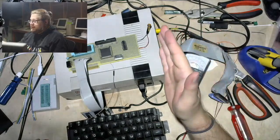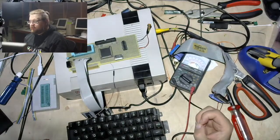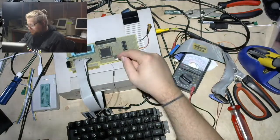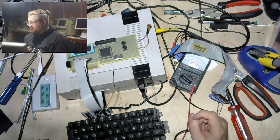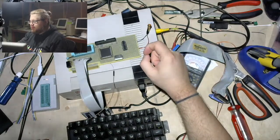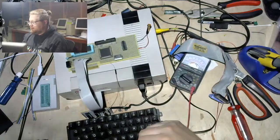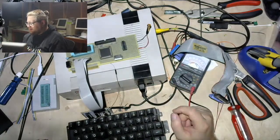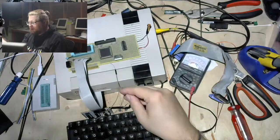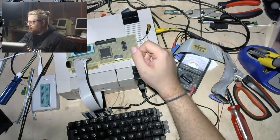Last time, we discovered that this totally does work fine for those purposes, but it doesn't seem to be responding to the address that we think it's supposed to be responding at. The floppy disk controller is at 8000. The EEPROM contents are currently available at 1000. And this is supposed to be available at C000. So it doesn't seem to be. The thing is, all of this goes through an MMC on the Super Mario Brothers 3 cartridge that is in here, that is hacked to allow us to do what we're doing. I probably don't have that set up right, because all of those mappings are configured through the MMC3. So you can place where different things are in memory using that. I'm thinking I had this properly set up for C000, but that is probably not the case, so I need to review that.